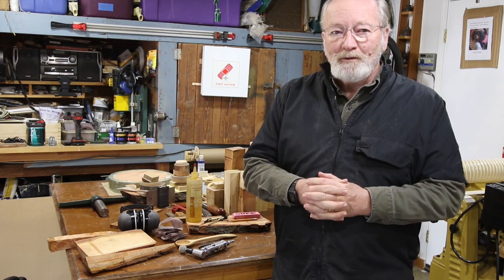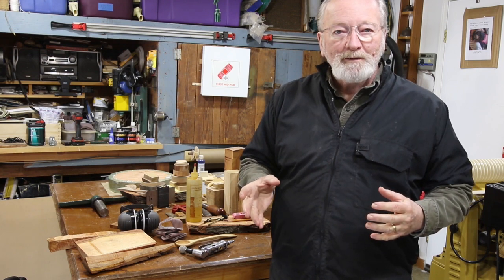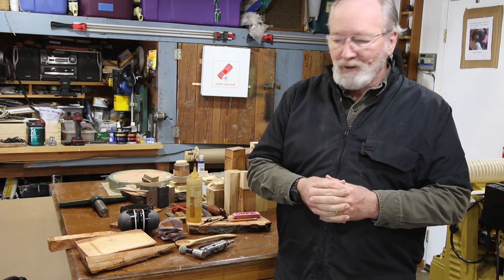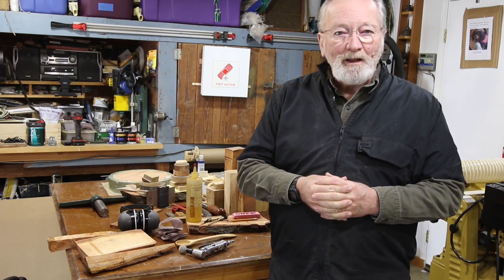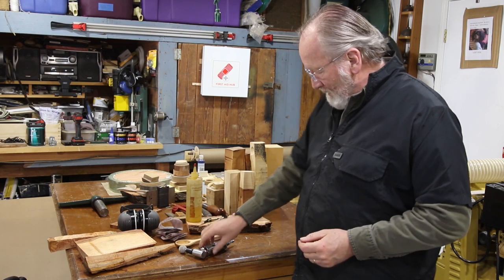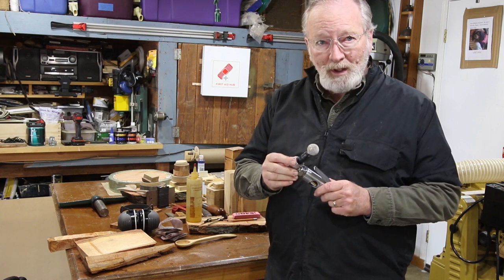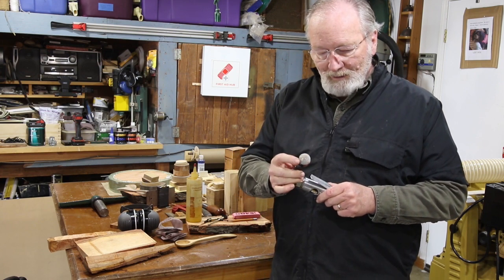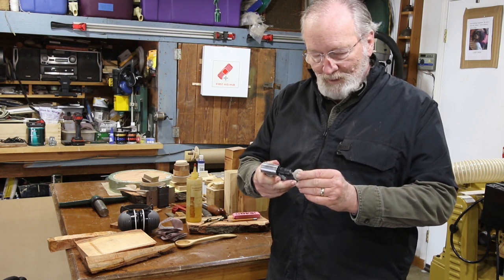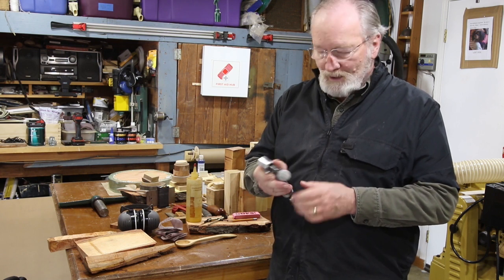Today I wanted to talk to you a little bit about power carving, something new for me, and I started to do this video for a nephew of mine, a gentleman named Clint. I've introduced a new tool to my arsenal, and that is a Kutzall. Now, Kutzall is a brand name, and it's spelled with a K. This is called a Rotary Sphere. It is a burr. I believe it's made out of a tungsten carbide, and it's on a 1/4 inch shaft.